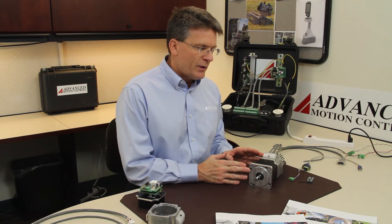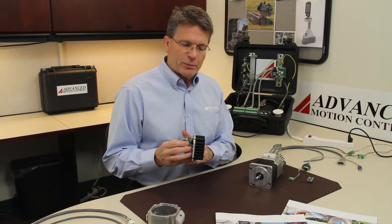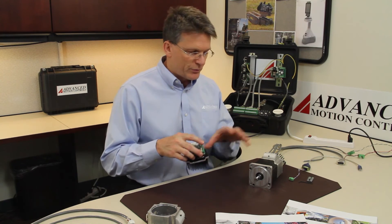In summary, we're talking about the integrated drive motor. This is a NEMA 34 frame working with TrueTech Specialty Motors out of Plymouth, Minnesota. The final sale sample designs will not have any fin heat sinks — it'll be a flat base plate. We've used again the standard Z drive with the interface mounting card that we've made to adapt to this frame.